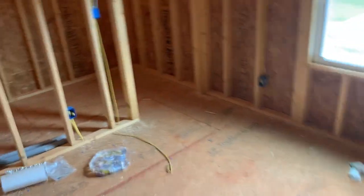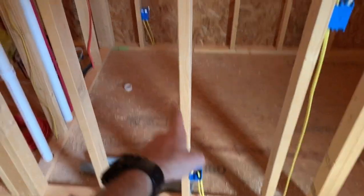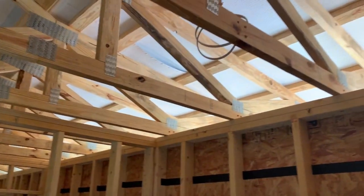Then the closet, we jumped it the same. We just went, pretty sure, from that one over to that plug and then that switch. I don't know, we may figure it out. We may decide to just bump with 2 can lights in these bigger closets. Small room, same way. We did exactly the same way. Went to the first one and then jumped to all of them. And then we also run power to the switch. Then we got to run from the light to the top.